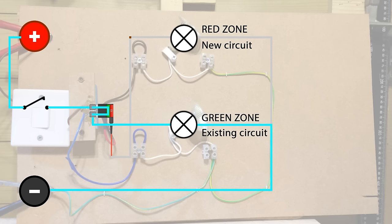So let's have a look at the red zone. The power comes from the battery — this time it doesn't pass through the green fuse, it passes through its own separate red fuse. It continues down the red tail of the piggy all the way to the lamp, then passes through the green cable into the chassis, completing the circuit. And that's all the boring theory out the way — let's run a video and see this all in action.